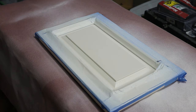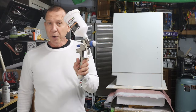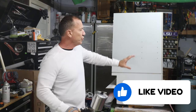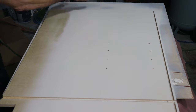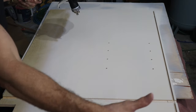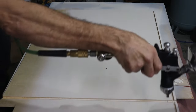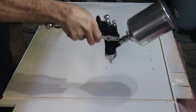There's a little flash on top. The damaged area was right here — Sherwin-Williams did a great job matching the paint and it all blended in. The drawer face came out perfect. The proper gun makes it so much easier. I'm going to show you how well it sprays on this panel — I'll keep my trigger down the whole time and not let up, because if you let up you could get a spurt when you start back. Keep your flow even, even distance.